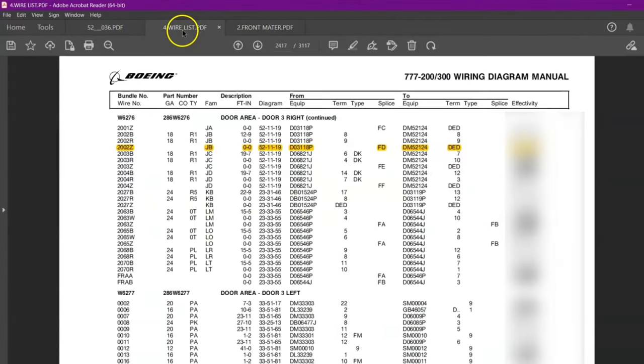So we'll go in this and then it will give us all the detail, the part number of the ferrule, the part number of the tools which we want to use, and each and everything with the diagram, how much we have to cut, from where we have to insert the wire. Okay, you can see, and you can go in detail for installation procedure for the grounding wire, which is chapter 20-10-15. Okay, so I'll just quickly write down over here, chapter SWPM.